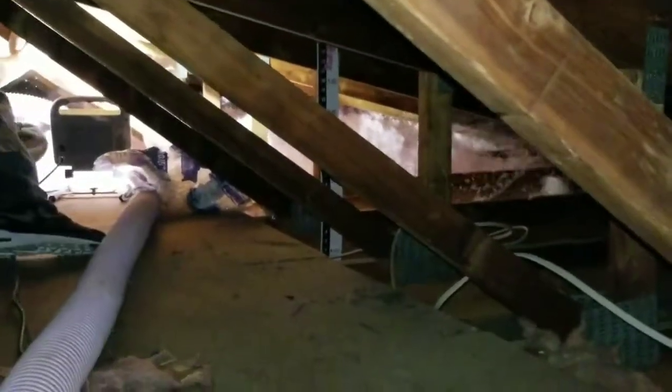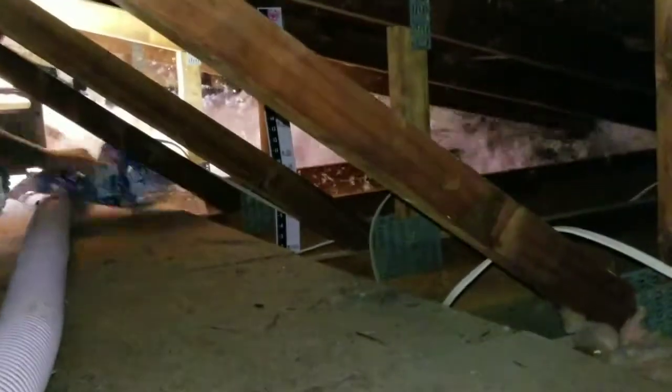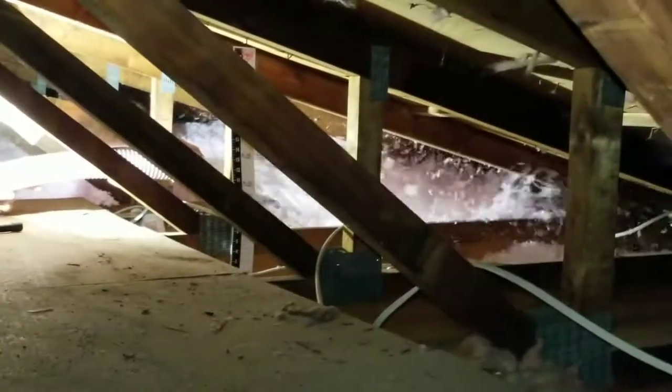So here's Curtis blowing in the insulation. Like I said, when he gets down here to this deck board that you can walk on, he's going to blow it underneath. Gotta blow it underneath. A lot of guys forget to do that kind of stuff. Being sure to make sure it's thick all the way through. Same level. Not the funnest job in the world to do. Don't get cheap on your material. One and done. One time. Nothing like crawling over top of all that to put in more because you didn't put in enough. So we make sure we do it right.